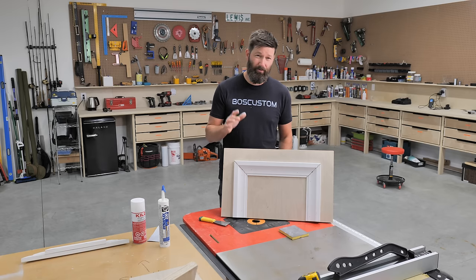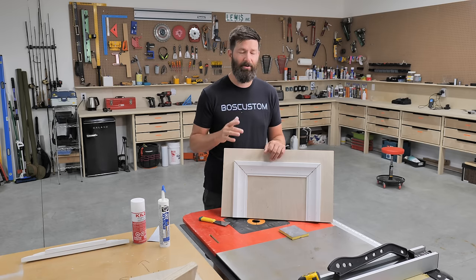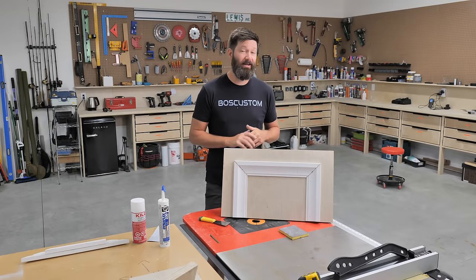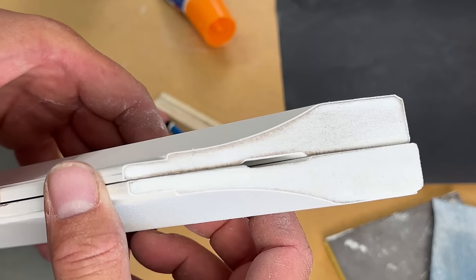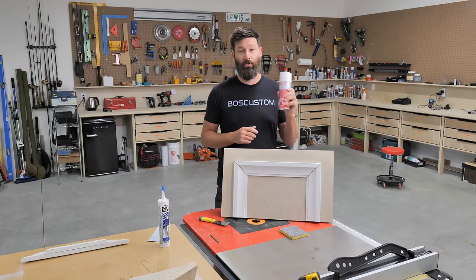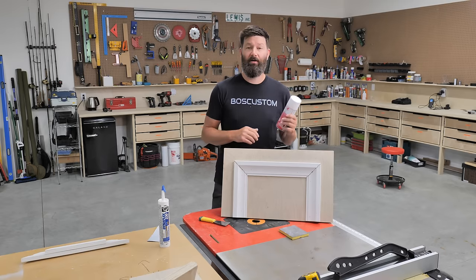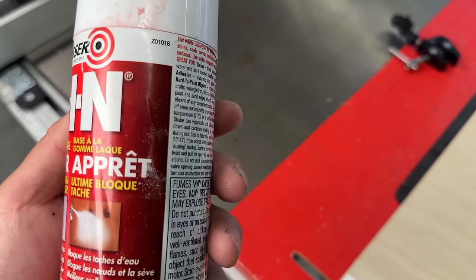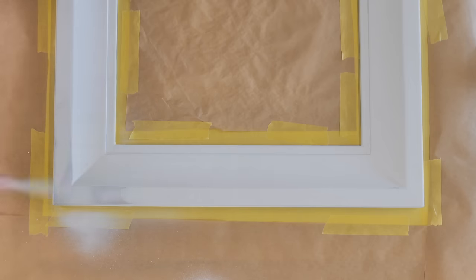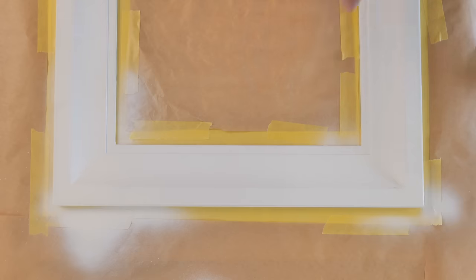Now you want to prime the filler. A lot of people will just go straight to paint, but priming is going to make things look considerably better, especially if you've gotten into any bare wood. The mistake a lot of people make here is using a water-based primer — anytime you have raw wood, water-based primer is not a good combination. I like to use an alcohol or oil-based primer. Kilz is a really good product, and Zinsser makes a good alcohol-based shellac primer — I'll link those in the description. Shake the can vigorously and apply light to heavy coats over those filler areas. Primer will also fill in any really small imperfections and you'll get a much nicer job than if you skip this step.